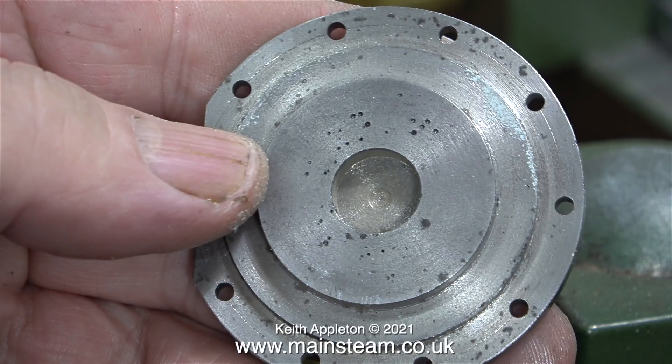That's quite an intelligent guess I suppose, but I think the real reason is that the top of the piston is shaped like a dish to reduce its reciprocating mass, which on a reciprocating steam engine is always a good thing to cancel vibration. As a piston rises up in the cylinder it meets this protrusion on the inside — it doesn't collide with it, it just fills the empty space when the piston is at the top. I think that's what it's for. If there are any bona fide experts out there who really know what it's for, please put me right.